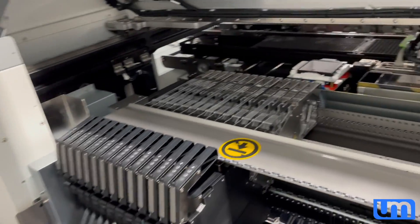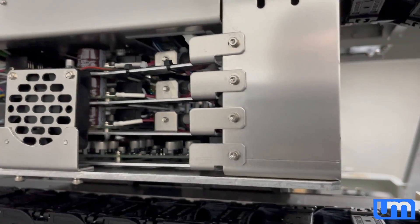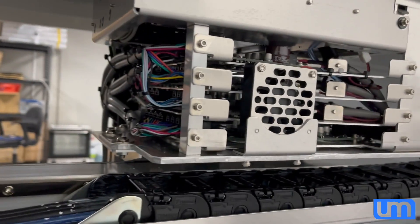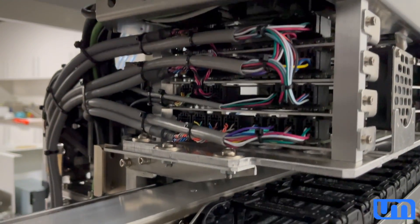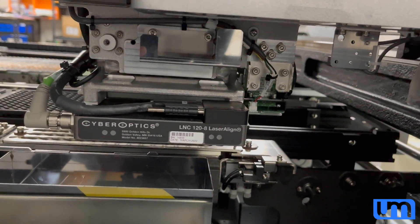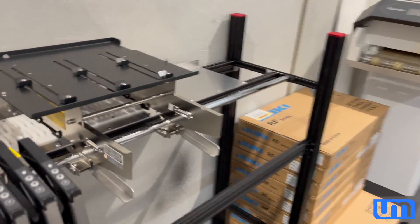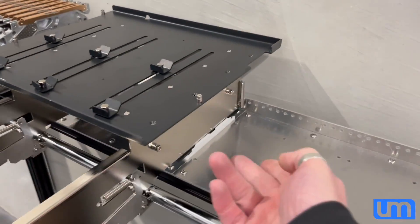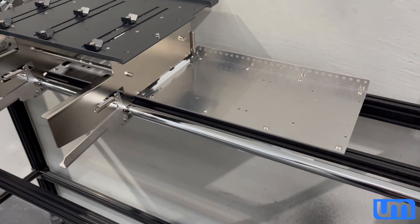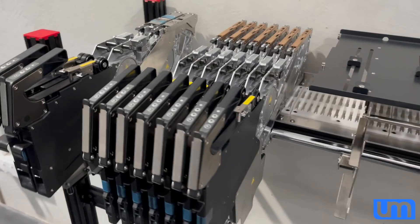Let's go around to the back. That's the back of the pick and place head — you can see all the hardware inside. There's a really big cap in there, the shortest and widest electrolytic I've ever seen. Fans everywhere. There's the CyberOptics laser system — the laser curtain, as they call it. There's the nozzle change tray. This is the feeder area with my new feeder rack that I built. I'm still waiting for some more plastic parts from Juki coming with the vacuum system upgrade. I've got aluminium plate cut — I designed it all up, cut it on my laser cutter with acrylic to check alignment, then got the pieces cut out of metal. Around the corner I've got spare feeders, and that's the static tray holder on wheels.